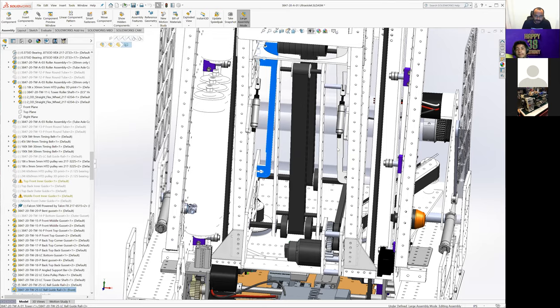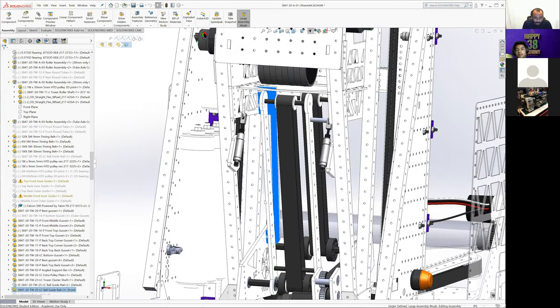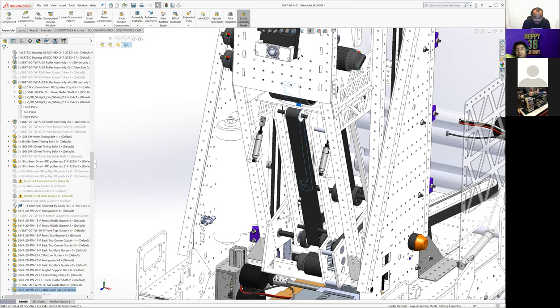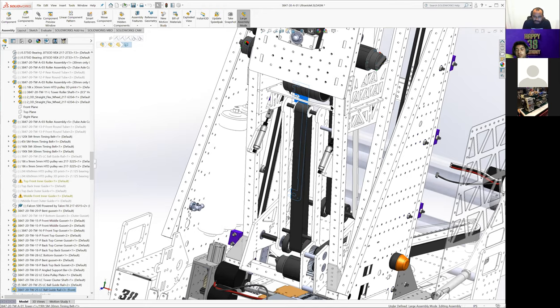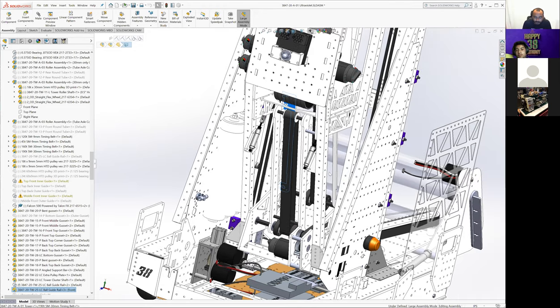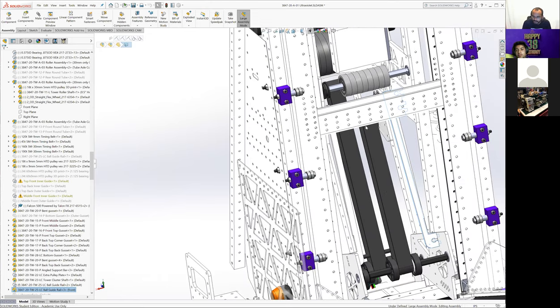So there are these two front rails that start out wider at the bottom and get narrower at the top to center the ball as it goes up. This prevents the balls from going off too far to the sides. There used to be ones back here, but they were not allowing us to use our back movable belt well. Anytime we had these back ones in, the front belt alone could still pull the balls all the way up to the shooter, which was frustrating. These balls are so grippy that as long as they're contacting a moving thing at all, they just move with it.